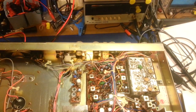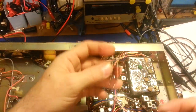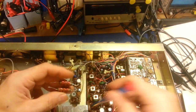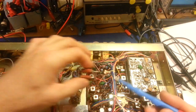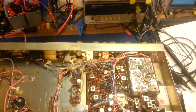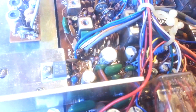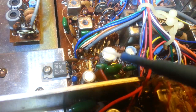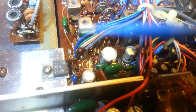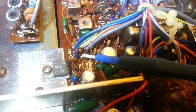If you have problems, they're going to be on this side - the component side - because there's a very small amount of solder here. I actually had this out because I wanted to check whether a coil was bodged in there. I unsoldered them and was measuring them with an inductance meter, and that's when I was looking at the solder traces and noticed - oh yeah, it's one of those. If you look down here, you can see there are little traces, not as much as on the other side, but there's plenty - and this one here is really, really bad.